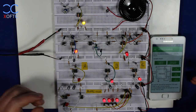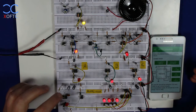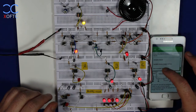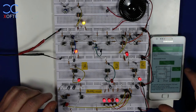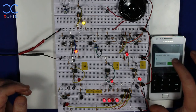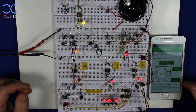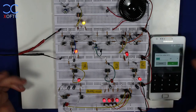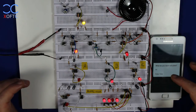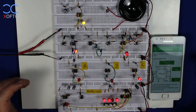But what I did, I have here 2 resistors in series to produce a 2 megaohm resistance. First I'm going to set my calculator to monostable mode, and R1, which is these 2 resistors in series, I have 2 megaohms. And my capacitor is 1000 nanofarads, which is 1 microfarad. And we want to calculate the pulse time, and we receive 2.2 seconds.